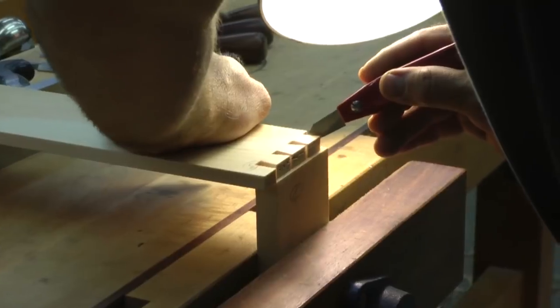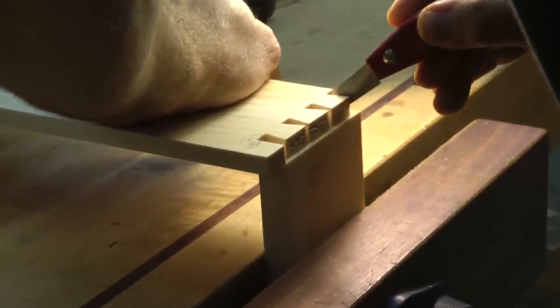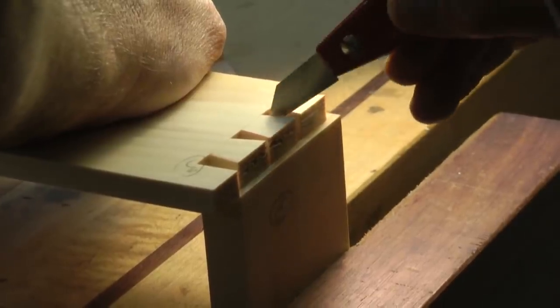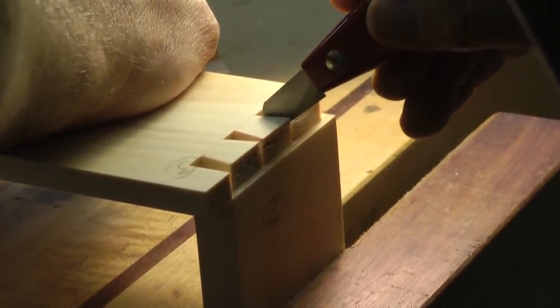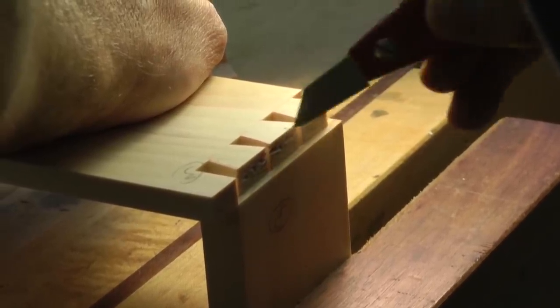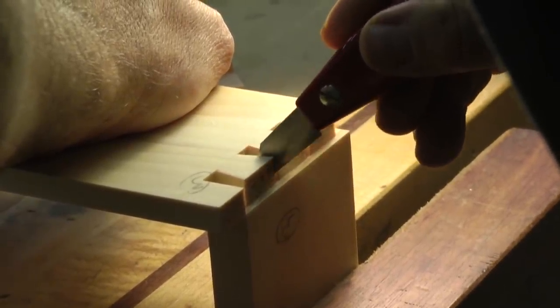Okay, bring the knife in, bend it up against the side, drag it through the end grain, not too much pressure. Make sure you stop before you cross that end lap so we're not trying to get rid of those heavy marks or worse, stuck with them.